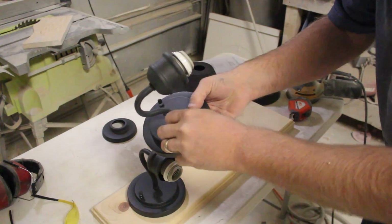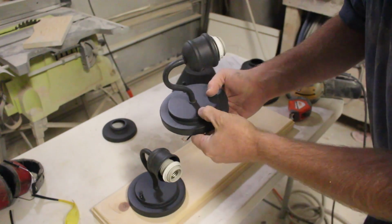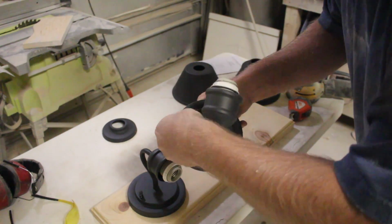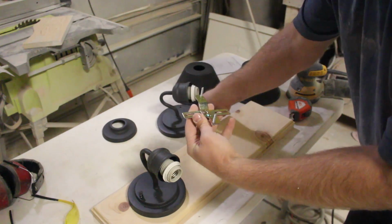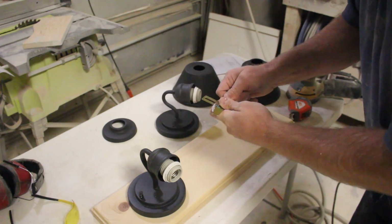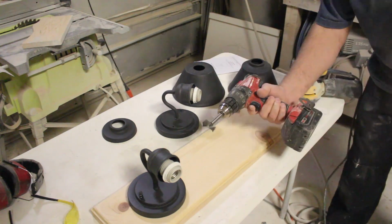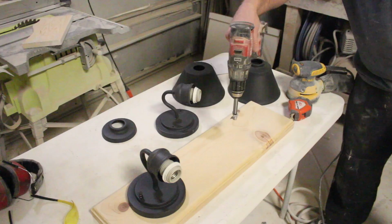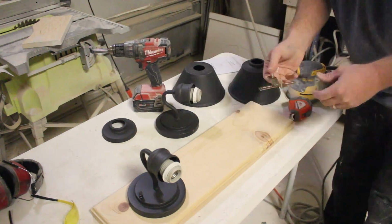It's got these 2 knobs on the support bracket bolts or screws. And they just come off right like that. And then now I've got my mounting bracket, which can be adjusted, looks like. And that just goes on here right like this. Before I do that, I'm going to drill a hole with my Forstner bit so that I've got a place to do it. So I've got to find center and then measure these out so that they're equal distances apart.